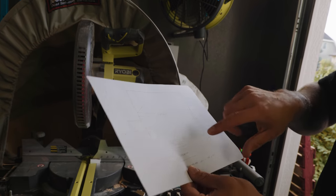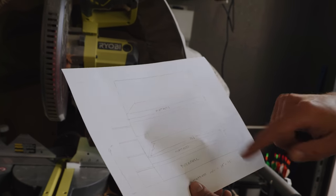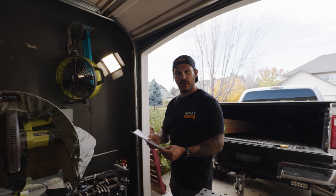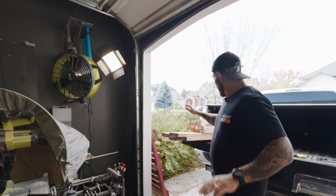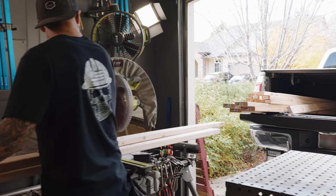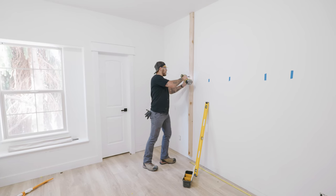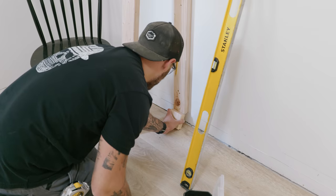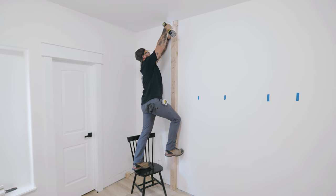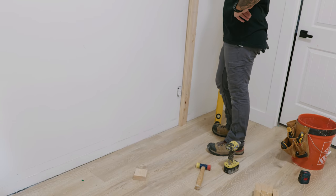This is just a rough size of it. The mattresses we're doing are twin size - 39 by 75 inches. I made an inch and a half more on each side, and by the time we start wrapping it with MDF or plywood we'll account for it. I have $120 worth of 2x4s and 2x6s to start building the framing. Stack the 2x4s for the pillars and attach everything to the wall. The outlet is always gonna be in the way of framing - always.